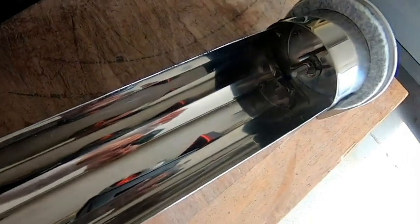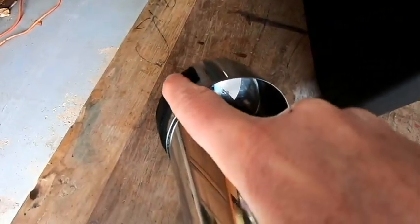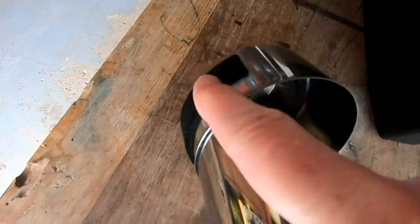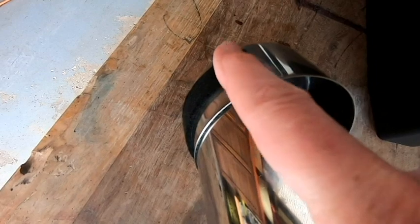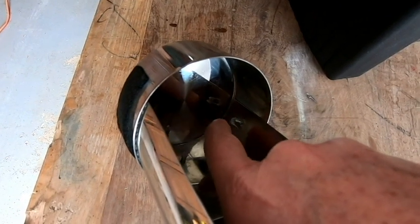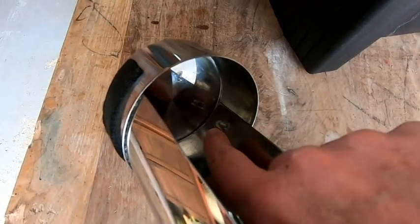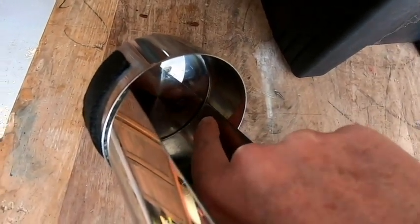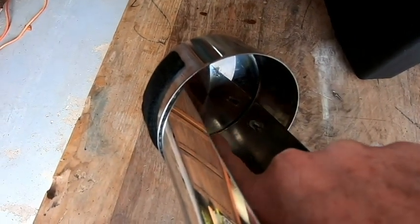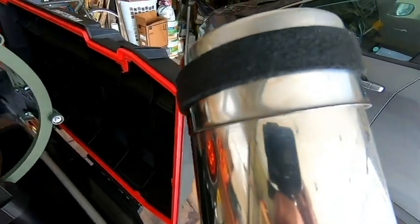Okay, here we are back again. In addition to putting the silicone on the rivets on the outside and adding this barbecue grill heat tape, I did go ahead and, because there are holes that go completely through the rivets from the interior of the oven to the outside, touch a little bit of silicone on the inner holes of these rivets as well. And then I added the heat tape, or the barbecue grill tape, both on the front and the end of my tube.